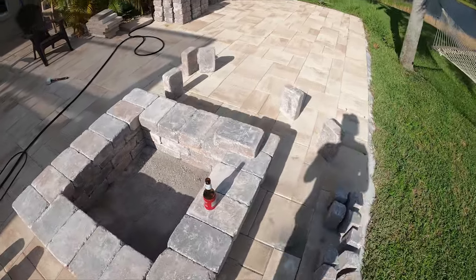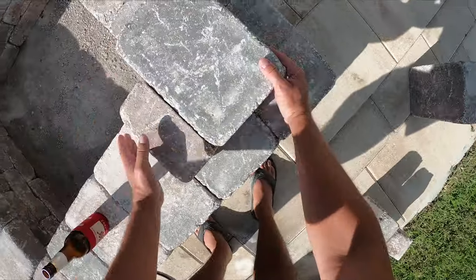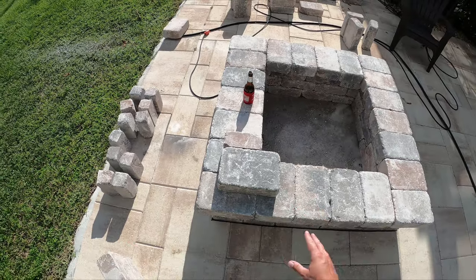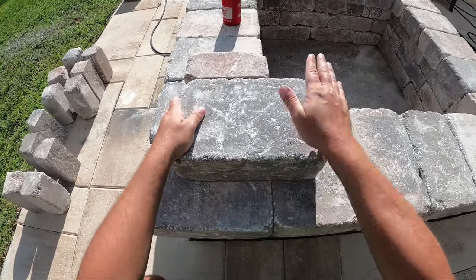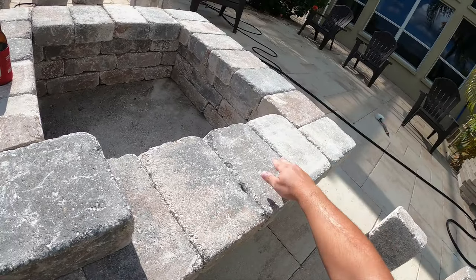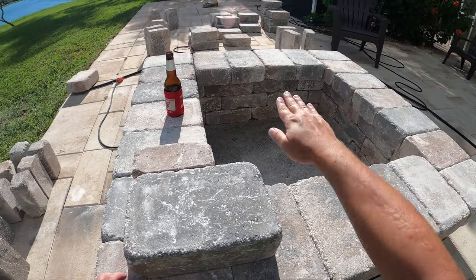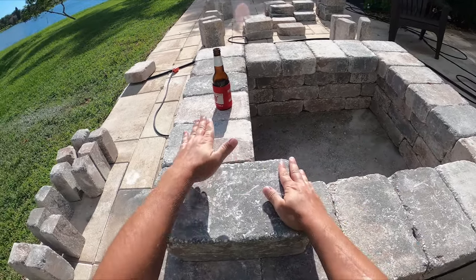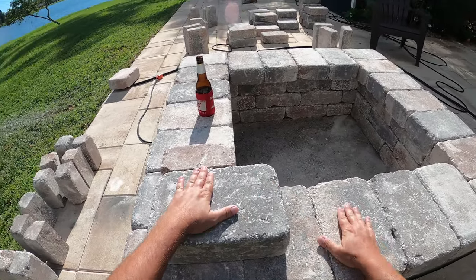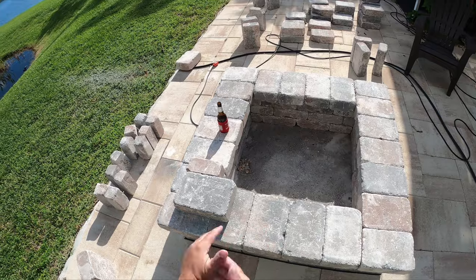Here's where I'm at — this is going to be the starting point for the column. I'm going to be super anal with this. I've got flat here but a little bit of an uphill there, so I'm going to grind that out and make sure these things are completely flat to this stone and then obviously level, so we've got the stone pillars going all the way up.